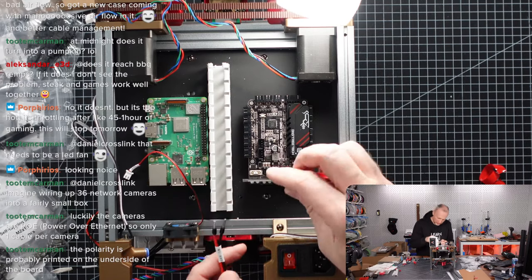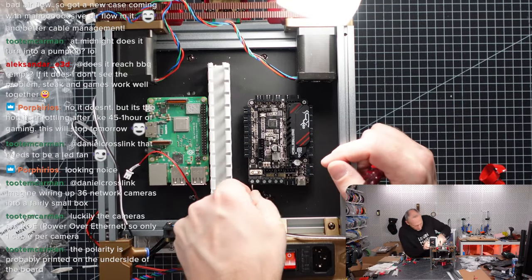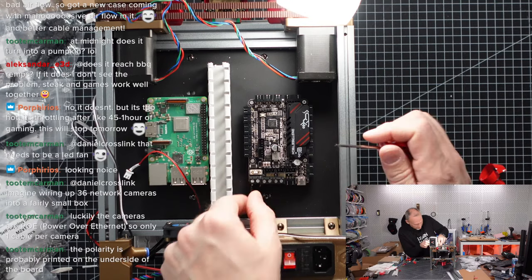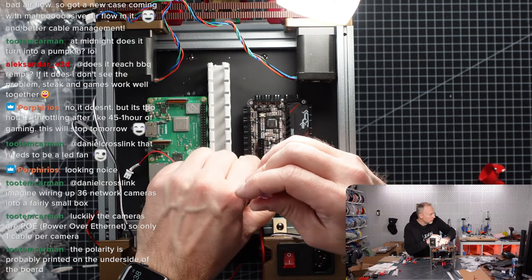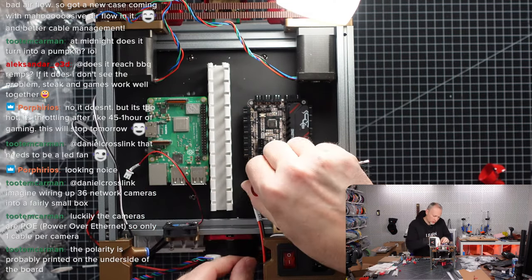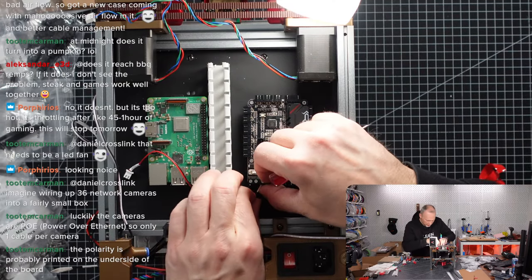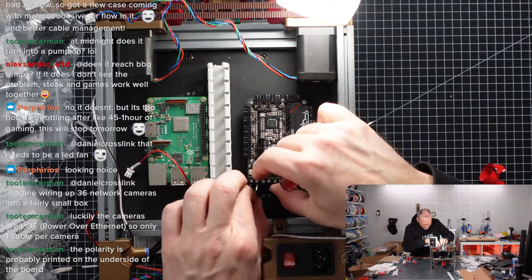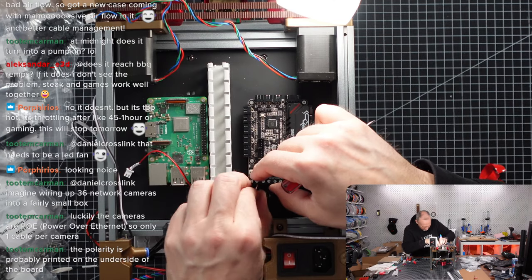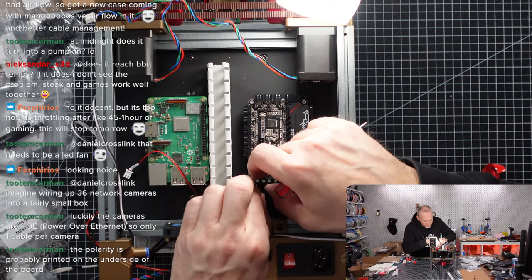They have these nice cable ends, obviously, but they are so thick already. It's okay. Working now. But we have to hold these terminals. You should not tighten these screws without holding the terminal, otherwise you might actually destroy it or remove it from the board or detach it from the board. Come on! I want to do this carefully. I don't want to destroy anything, honestly.